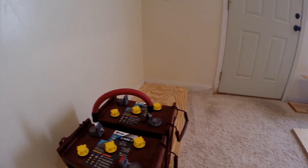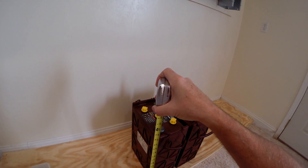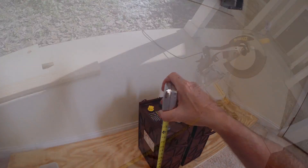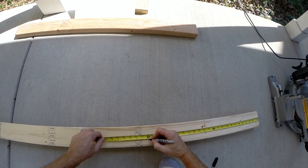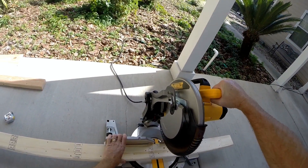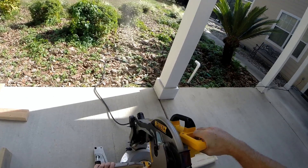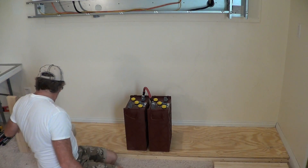I have to keep this at 24 because otherwise you end up wasting a lot of plywood — if you cut it more than 24 you can't get two pieces out of one sheet. So we're going to cut some 2x4s to 24 inches. Another nice thing is you're going to get four of them out of one stick. Just one on each end and one in the middle.